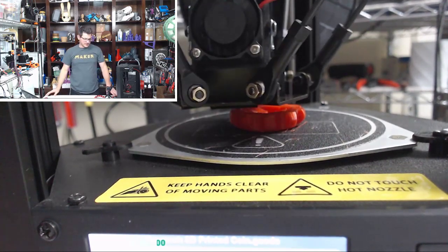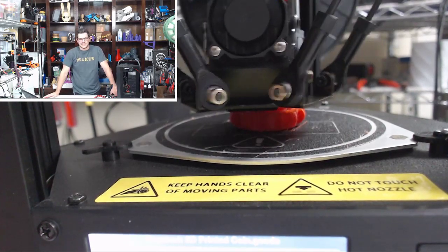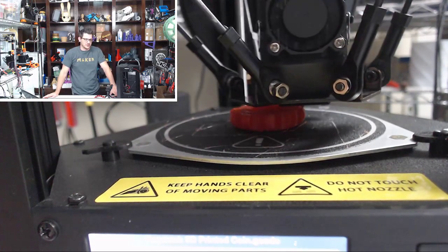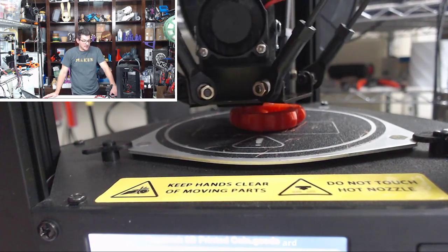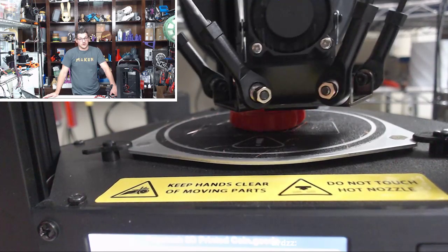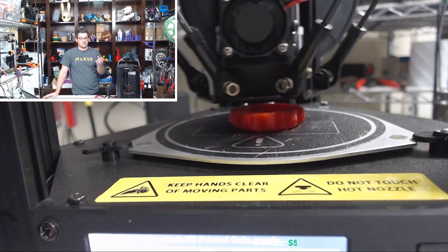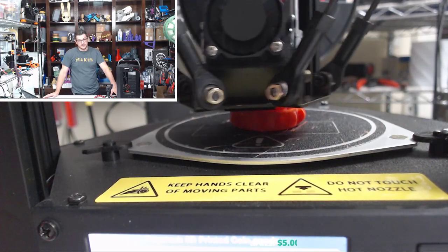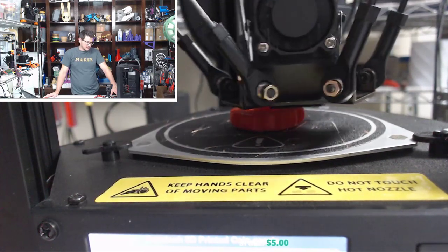Yeah, I mean, you can nuke it up to 2.0, it's 200% of the print speed. Again, that's 160 millimeters a second. I think pretty much if this was to go anything over 100, it might start to struggle. But if you put your temperature high enough, it might not. I mean, like I said, there is a fair bit of insulation around that hot end, or on the heater block. So most of that heat is going into that nozzle, which is being used to melt that plastic. So it could be very effective. And that's why it's able to go at this speed at only 200 centigrade.